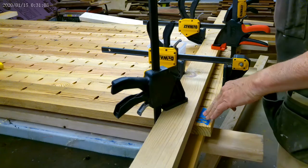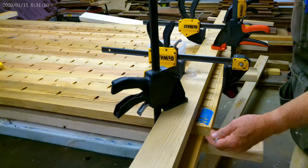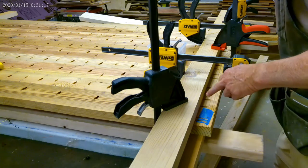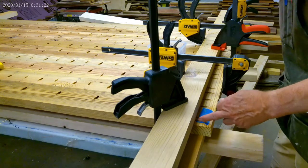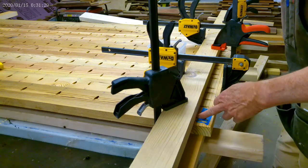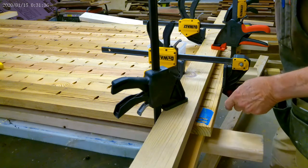This table will have a small routered rounded edge on the bottom and a slightly larger one on the top, plus rounded corners. So you want to keep in mind where you put your screws. I drilled one that I thought was a little close to the edge, so I moved over — I'll leave it blank and just plug it, then put a screw further in, because you always want to keep your routered edge and rounded corner in mind.